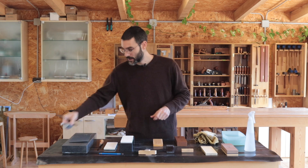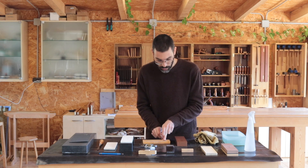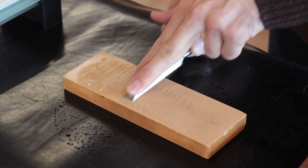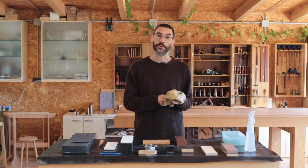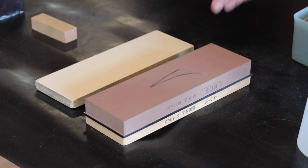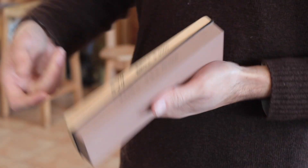That's been about 20-30 seconds at the most, and now we only need to work on the flat side at the finer stone to remove the burr. And that's it. Only two stones — it's all you need to get a razor sharp chisel. And of course you can get them as a combination stone; I have one here which is 1000-6000 and it will give you everything you need to get started.